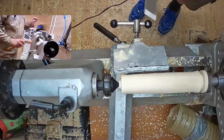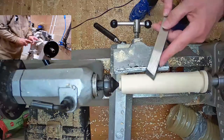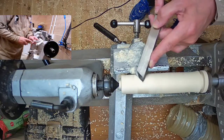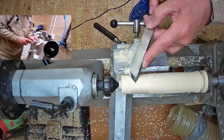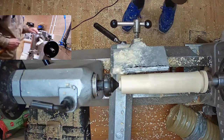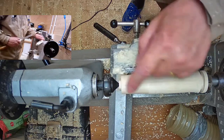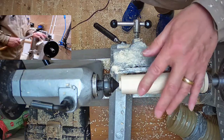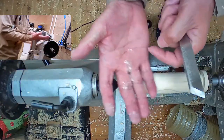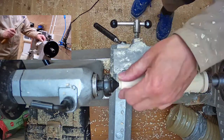To use it normally on the tool rest, just slowly rotate it and hold it lightly - I want it cutting about halfway. Hold it very lightly and you should see really fine shavings coming off. Let's just stop that and have a look. Even though you'll have to take my word for it because it's quite reflective - that is so smooth. Even 400-grade paper would not get it any better. All you're taking off is really fine shavings - they are shavings but they're so fine. That's the idea: to get a really smooth finish and cut out sanding.